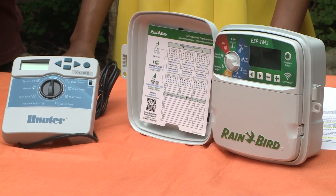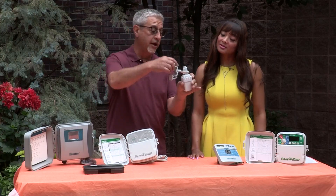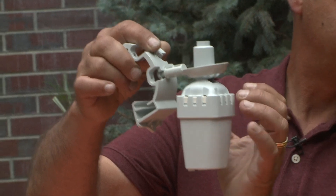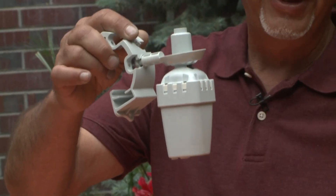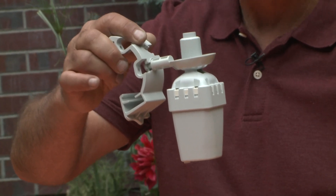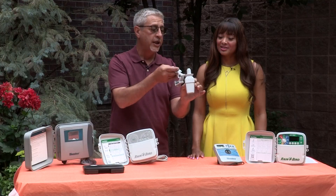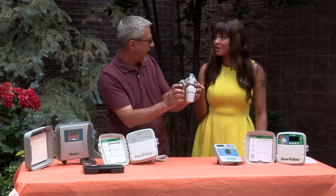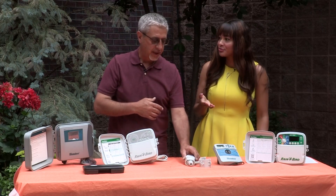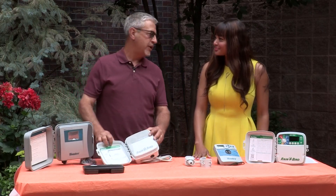The second component you can add is a rain sensor. This will hang up on the gutter of the house. When it rains and a little filament in here gets wet, it interrupts your controller and won't allow it to run for a day or maybe two. That's a great way to save water — adding a rain sensor. There's also a rain gauge option. That might help you out if you're just away from your home for a day or two. If you're gone for the weekend and it rains, why waste that money?